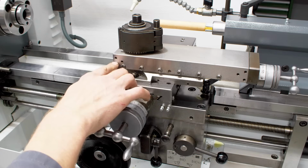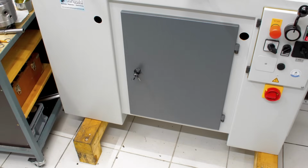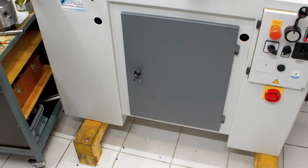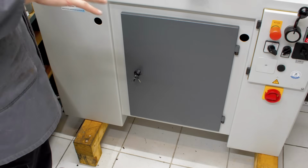All the holes for mounting linear scales are already here. This machine used to have linear scales in the past. It was an ancient Heidenhain system as far as I know. Funny detail, they put the machine on some wooden blocks for shipping, so I can grab it with a pallet truck lengthwise, as you have seen in the transport picture. But this also puts the machine at almost the perfect height.